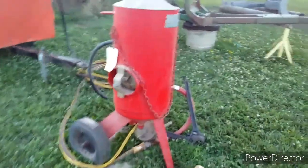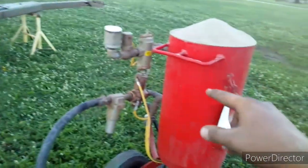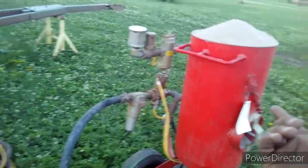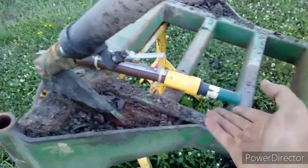I thought I'd explain some of this stuff. This is called the pot, or sandblasting pot. That's an air compressor, and the air compressor pushes air down through the hose all the way to the sandblasting pot, which then lets the sand go out, pushed by air, through this all the way to the end nozzle, which you saw us running.